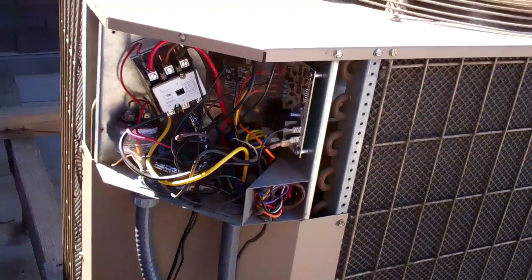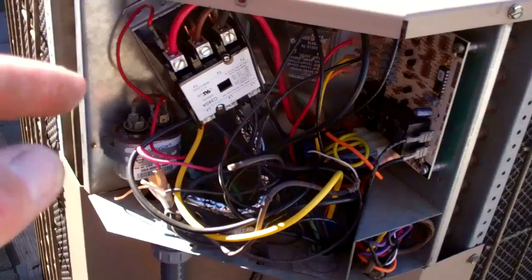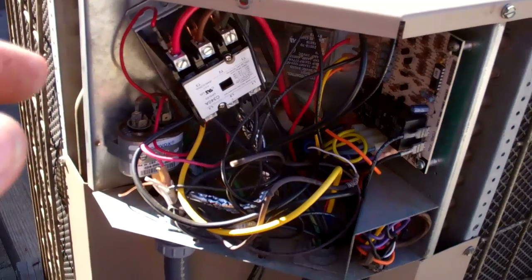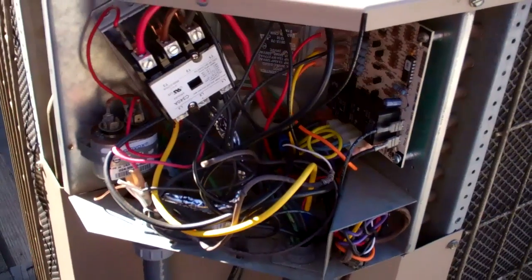Here's a York pump. I'm having trouble pulling in the contactor. I'm getting 27 volts no load, and when it pulls in I'm only getting 8 volts.